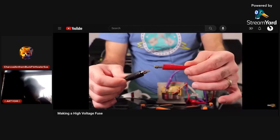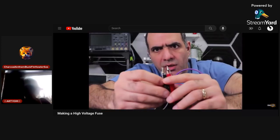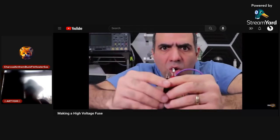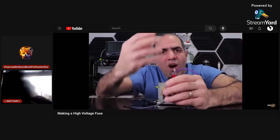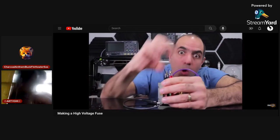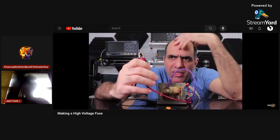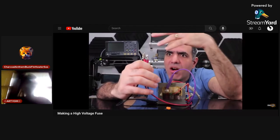Look at this. Even the glass cracked and broke under extreme heat. The voltage rating is not about the normal operating mode. It's for when the fuse breaks open and we want it to reliably open. We know a strong high voltage can jump the gap, creating an arc, keeping the circuit closed, like we saw. So in order to make sure a fuse or breaker actually opens, it needs to be made differently. Otherwise, the arcs never die.